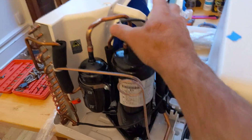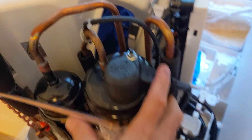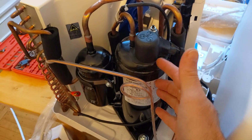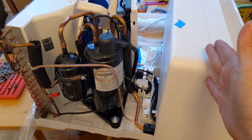So I'm glad to see that someone has finally brought this design to the window unit market. Let's take a look at what's going on in the outside package. You can see the UVW — this is a variable speed compressor. Beautiful. They can run this at any speed they need to and have the speed match the demand coming from the inside.